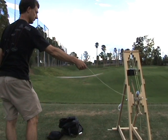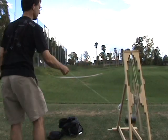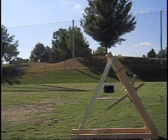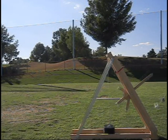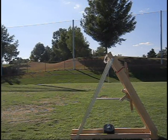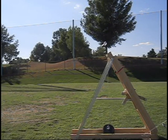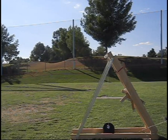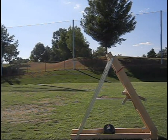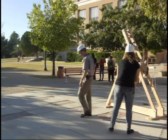For counterweights above 30 pounds the simulation diverges from reality, and it takes me a while to figure out that frame compliance and cord stretch are soaking up huge amounts of energy. Note how high the counterweight bounces after release — and the cord holding it is no ordinary rope, but a 900-pound Kevlar spearfishing line known for its extremely low stretch. Nothing here that a couple of 2x4s and some thick rope won't fix — and you're right. But I believe I can model and optimize this with structural dynamics, because if I'm right, high-performance trebuchets can be built with cheap materials.